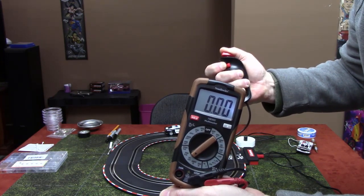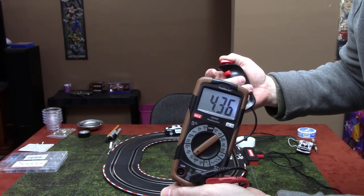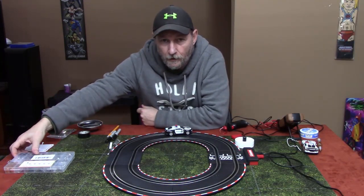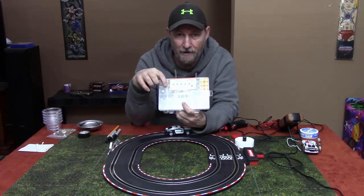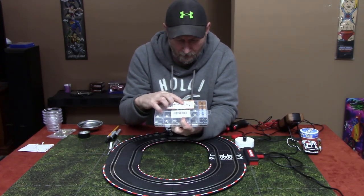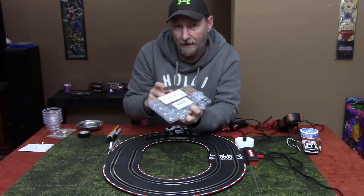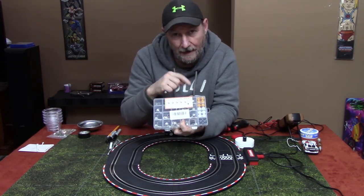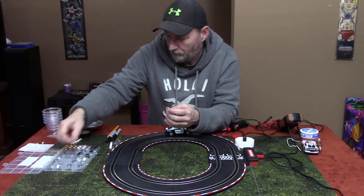That's what we want to mimic — the ability to set resistance at some range between 10K and zero. The next thing you'll need is a potentiometer. You can buy them in specific values, or like I did, buy a range pack. I got a pack ranging from 5K all the way up to 100K — 5K, 10K, 20K, 50K, and 100K. If you're just doing this project, you only need the 10K, since that matches the resistance of the controller plunger.